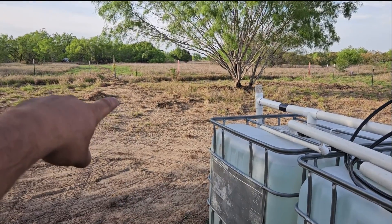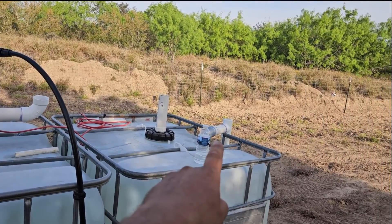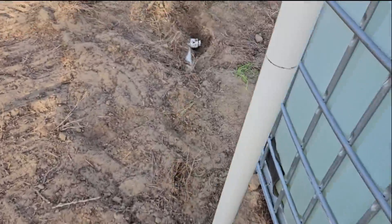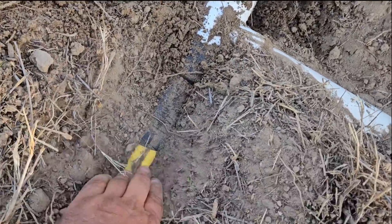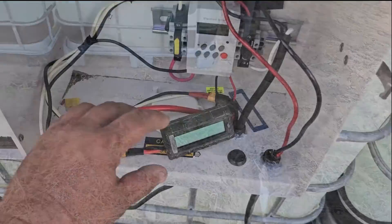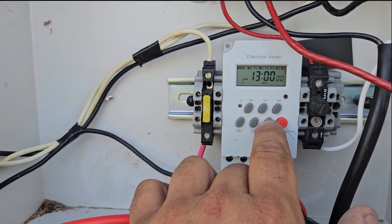The water comes from a water well over there — comes in here, goes to the top, and once all the tanks are full it goes through the overflow down to that mesquite tree. We got 500 feet of two-and-three-eighths gas line that I'm using for water. Here's the clean-out I put in — you can see the yellow pipe there. I uncovered this because I covered it two days ago and it was wet, so there's a small leak — I need to put some Teflon tape there.